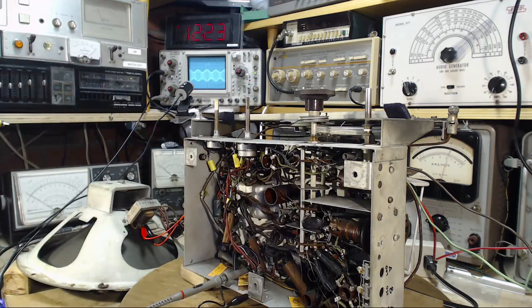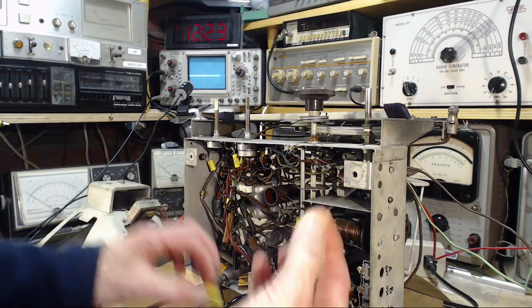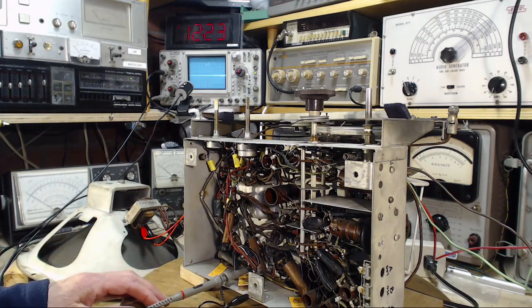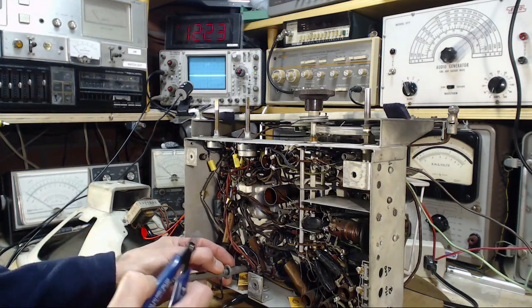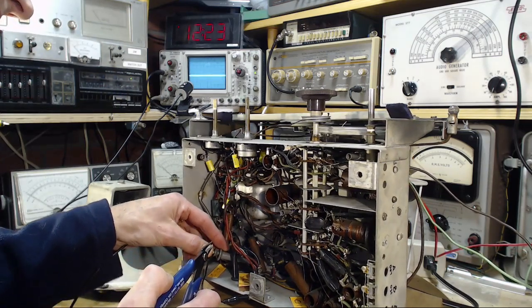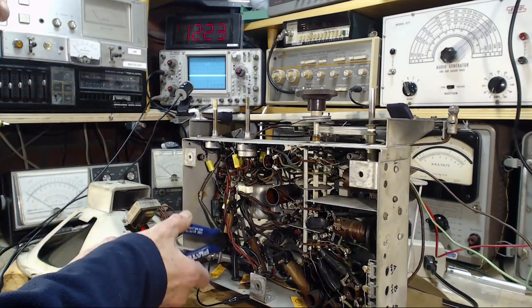Okay, without changing any of the test equipment, I'll remove that capacitor. We will test the capacitor. Then I will install the new 0.05, and I better get this one out of here or I'll install the wrong size. Let's nip it out of there. I'm going to relocate this to here. This wire here. There we go. Definitely. And this one here.